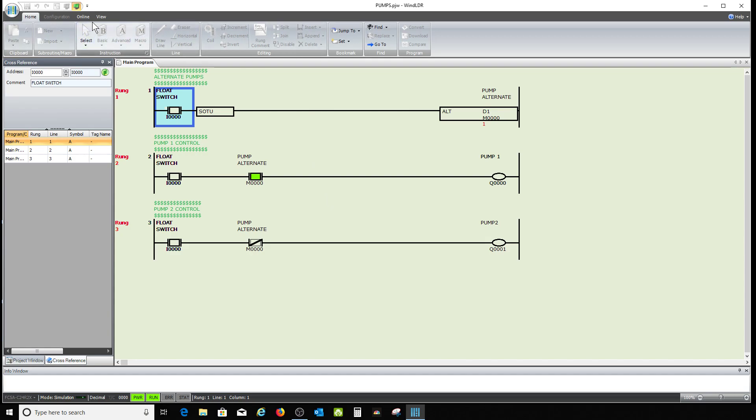If you want me to expand on this and add some of the other stuff, just give me a note and bear with me — I am starting a new job. Now, any time you're dealing with pumps and float switches, you want to stay away from something called 'hammering.' When a float switch activates, especially in a tank or a fluid pond, you can have turbulence that makes the float switch oscillate up and down, causing the pump to go on, off, on, off — which will wear out your contacts, your starter, and do damage to a VFD.